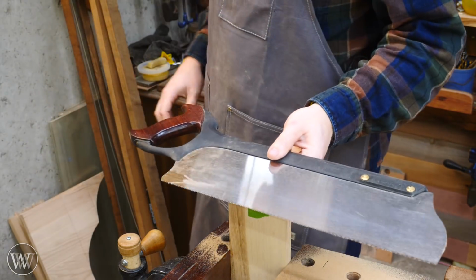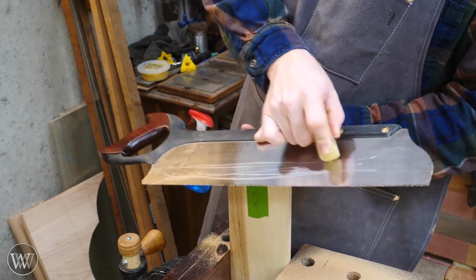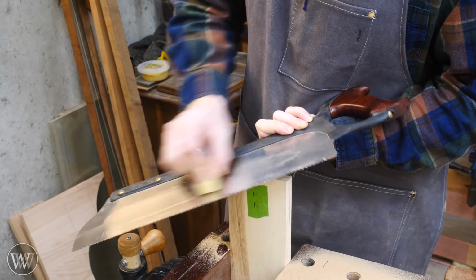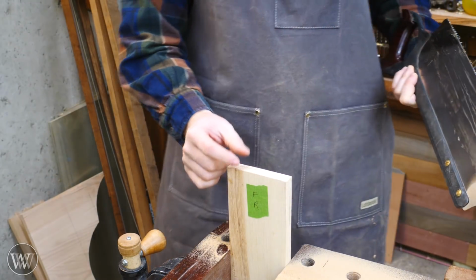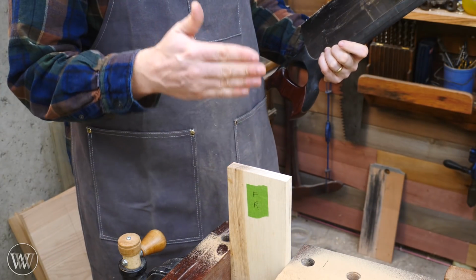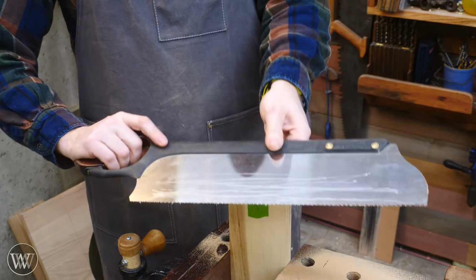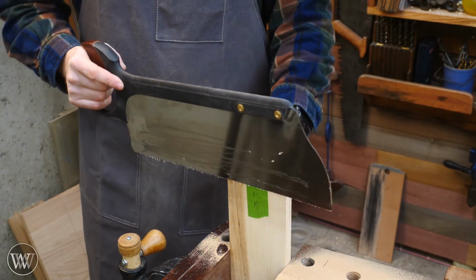Number one, you might want to oil up your saw, either with some beeswax or paste wax. I normally use paste wax, but the beeswax is just right here. I like to get some right into the teeth. This just makes it go that much easier through the surface, especially when doing a larger cut that it can bind up in. Now, I could use my big frame saw and cut this as if I was resawing, but the frame saw is a little bit less accurate, and I'm not going to get quite as clean a surface on the inside. So for that, I'm going to be using a larger tenon saw. This has a rip cut, it's a deeper gullet so that it can go down a little farther.